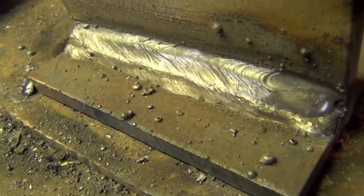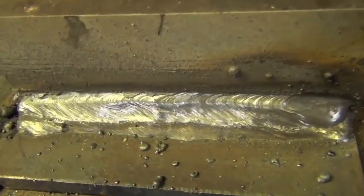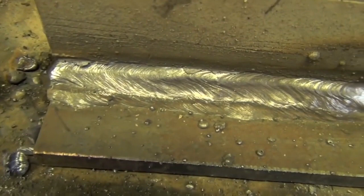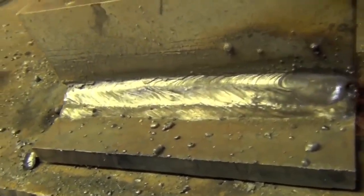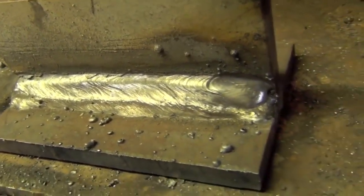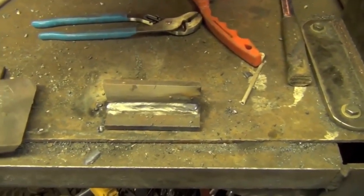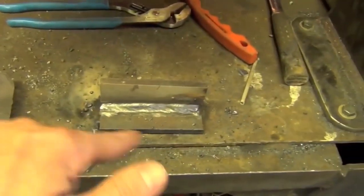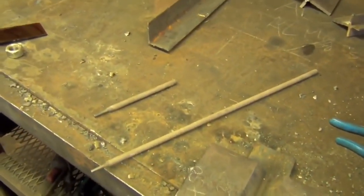We only have a minimal amount of spatter, especially considering the amperage we were running and the fact that this is three passes. It's been about 2 years since I've run any large 7024; I tried once back in high school, and even then it was only once. I'm not really complaining, but as far as aesthetics, those aren't always the best looking welds I've seen. However, we did a three pass weld on 3/8 plate at approximately 200 amps, some a little bit more, some a little bit less, with less than one full electrode, and that's a 6-inch long joint, by the way. That is pretty impressive.